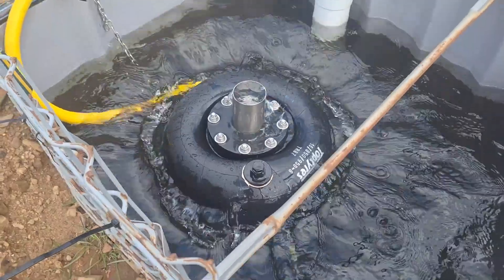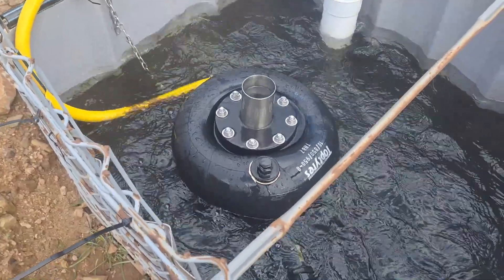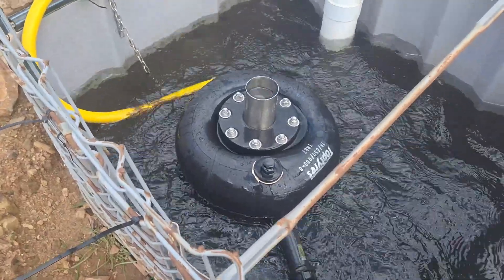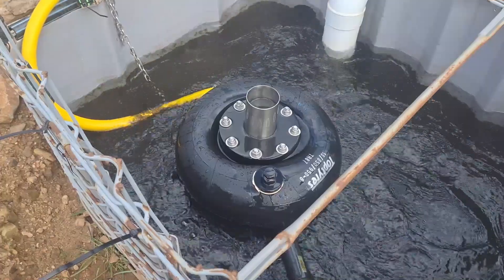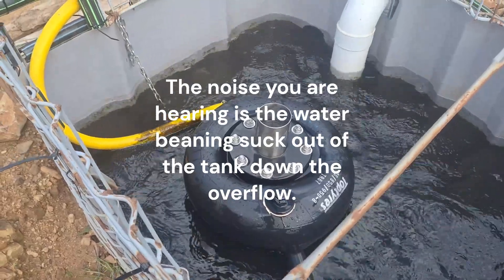I had a shorter stroke on it just before and it was pumping three and a half liters a minute, or a bit over five thousand liters a day. We'll go up to the tank and tap to see if output has increased by making the stroke a bit longer — by about 12 millimeters. It's about a 55 millimeter stroke now, as you can see as the water goes down.